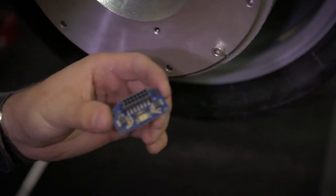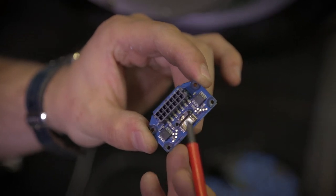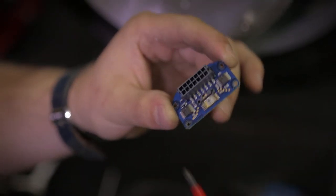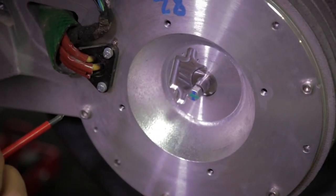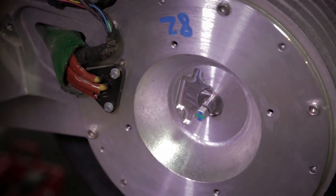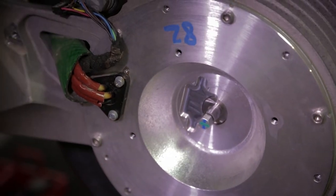Here we can see this part. There in the hole is a laser, and this is the sensor that reads the light pulses back from the lens. If this surface gets dirty, or the holes of the disk get dirty, or the lens itself gets dirty, the signal sent back to the motor controller can be corrupted or not precise enough. It will result in a not-smooth driving of the motor.